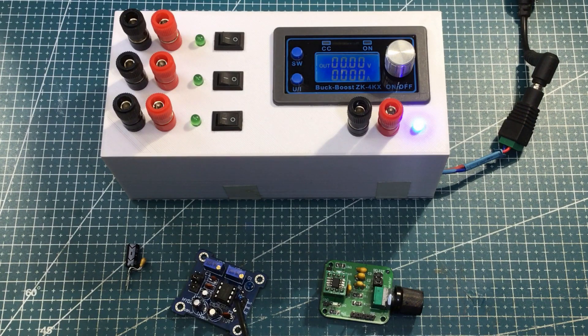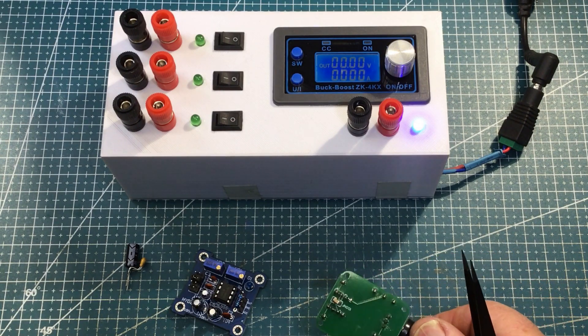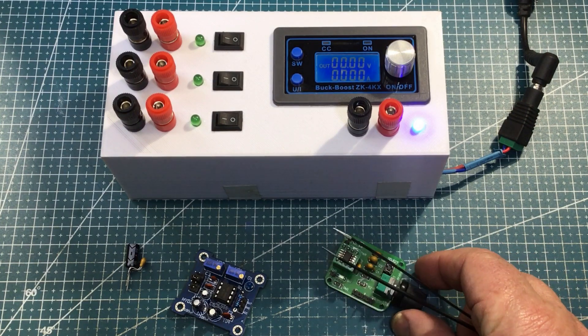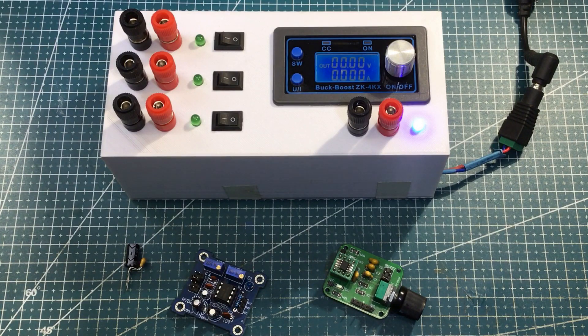If that doesn't work, I'm going to take out the 555 timer here and substitute in this one, which I know works. And if that doesn't work, I'll check all these connections again, but it could just be a rubbish PCB. One of the things I did on mine was to make sure that I used a good ground plane, and you can even see a little decoupling capacitor underneath there. So we'll give this a try with reconfiguring the power supply first, and then we'll go from there.